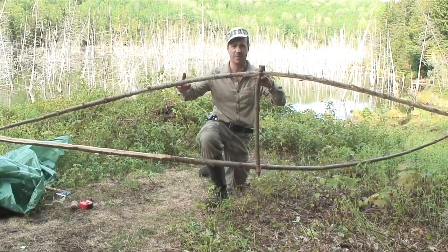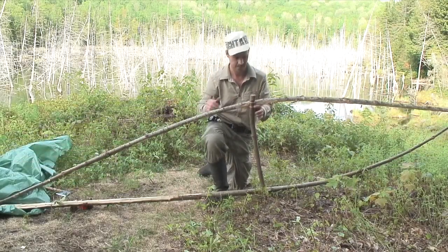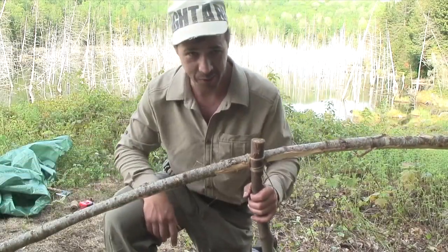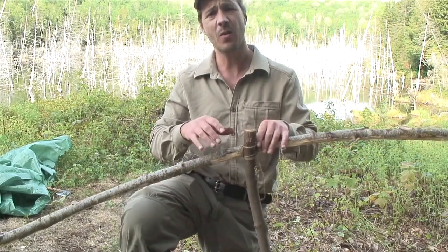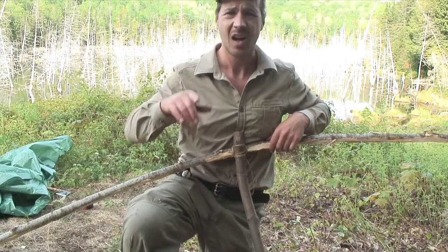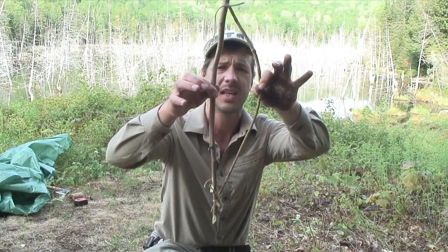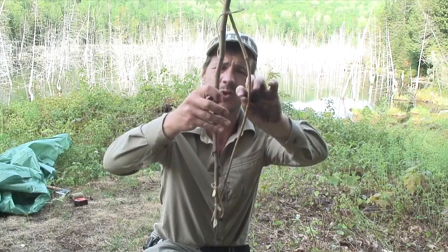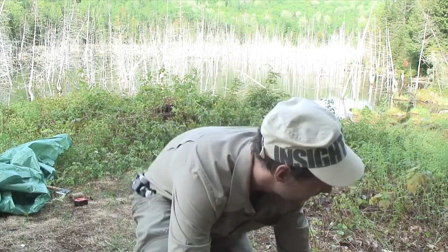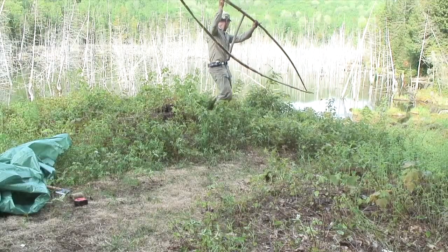Right now I've got the shape. This is the most difficult thing to do on this canoe. Get closer — serious things. Now we're talking serious. To go on well, if there is one branch that is thicker than the other one, I'll show you. If we extend it, you see what is happening? This one goes further this way and the other one doesn't want to move. This is why it's very important if you want to have a very nice hull — you really need this.